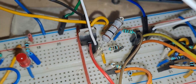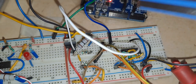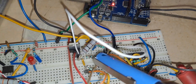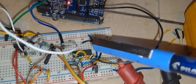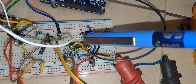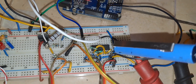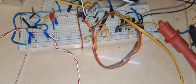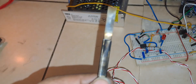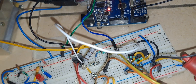There is a Wheatstone bridge as you can see here. Here is the Wheatstone bridge, and here is the op-amp in differential amplifier and unity gain buffer mode. The op-amp is LM324. This part of the circuit is processing the temperature and it is feeding to the Arduino Uno. This is the PT100 temperature detector, and it is wired in the Wheatstone bridge.